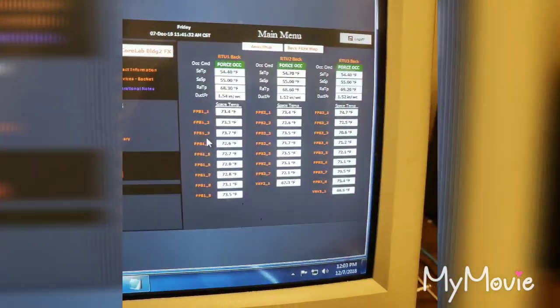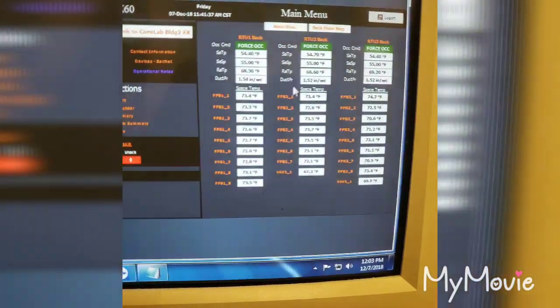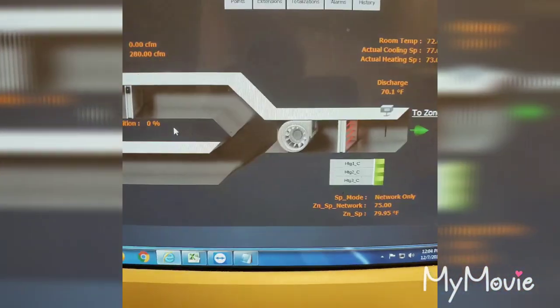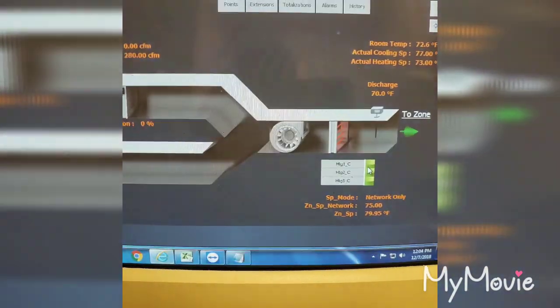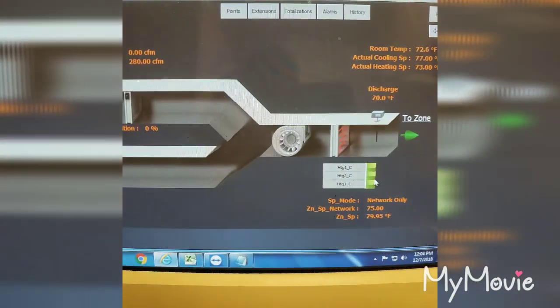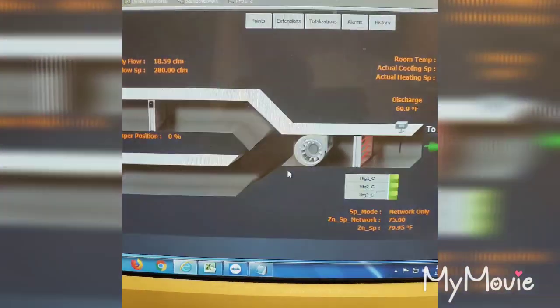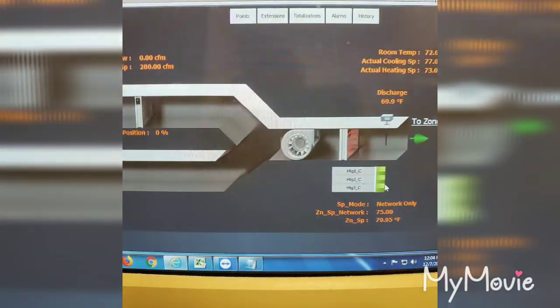Alright, hopefully you can see this, HVAC people. The original call was on this box here, 2-2. The customer complaint was no heat. So I just turned the power back on. As you can see, all three stages of heat is calling for cool. The front end is basically a thermostat. This can be W1, W2, W3.